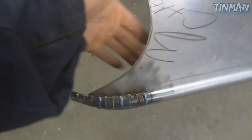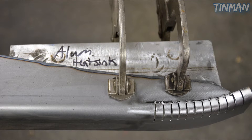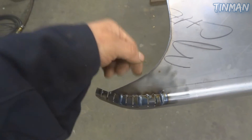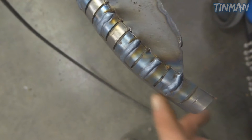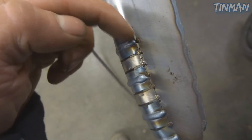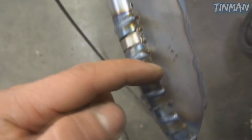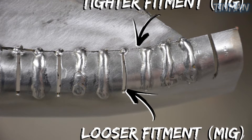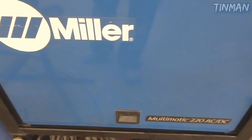You can clamp an aluminum heat sink to the flange here — I just don't because I know it's going to shrink anyway, so I might as well just hammer it out afterwards. When you weld, stuff will shrink, so this edge right here will just pucker down a little bit. All I gotta do is hit it back out with a hammer and a dolly, stretch it back out. Then once all these face welds are done, I will weld these relief cuts down here after I hammer and dolly all this face so it's all nice and straight and smooth. Then I'll take and TIG weld up the top here — you can see that's nice and tight. My favorite part about having this welder is actually being able to switch from MIG to TIG on the fly — I just MIG welded all this up so I don't even have to get out of my chair, I can just grab my torch and hit it.